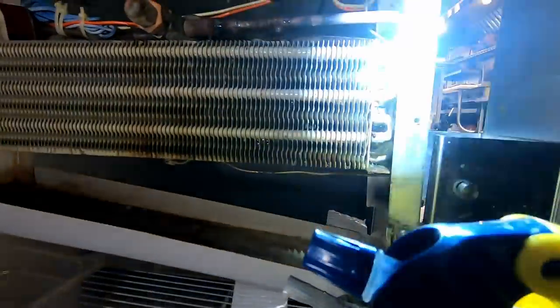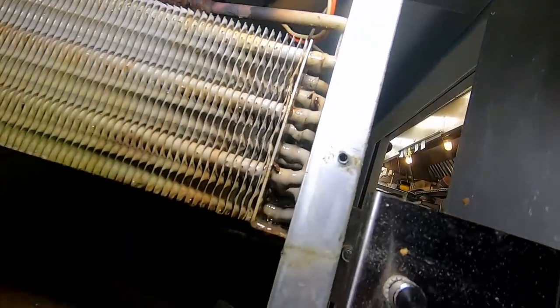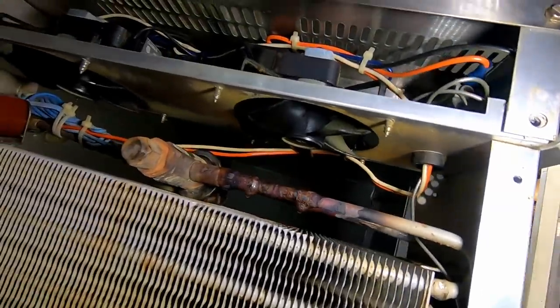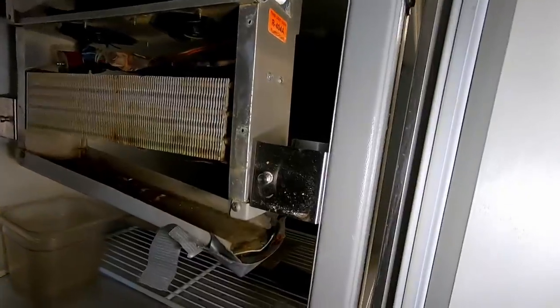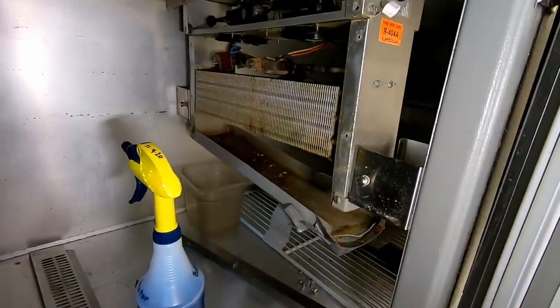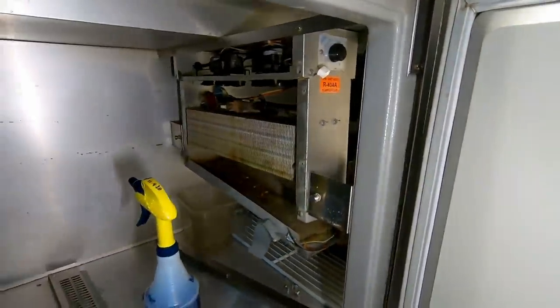For my business owners out there, a little bribery goes a long way. I can see a little bit of a leak right there at the very top - you can see it's down in between the coil. You should see the bubbles - granted that's about 200 to 210 pounds area, so that coil's never going to see that much pressure in service, so that's going to make it last a lot longer. We sprayed the top up there and nothing's leaking in that area. Things are tight right now financially - who knows, they may shut us down again. At least we found four big leaks: on the compressor suction line, two on the TXV, and one on the line coming in feeding the TXV. Let's get this thing vacuumed back out and recharged.